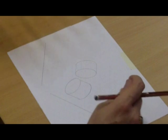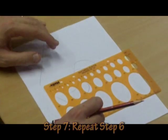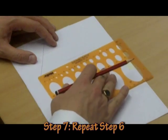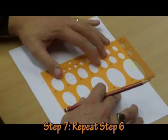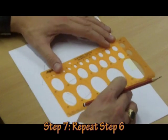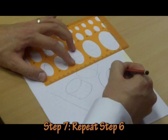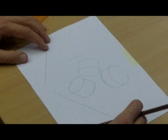The final one is for an ellipse or cylinder in the 90-degree plane. I draw a 90-degree line, line up the edge of my template with that line, draw my ellipse, drop it down the 90-degree line, draw half an ellipse, and join the two together. Now I've got three cylinders in three different planes.